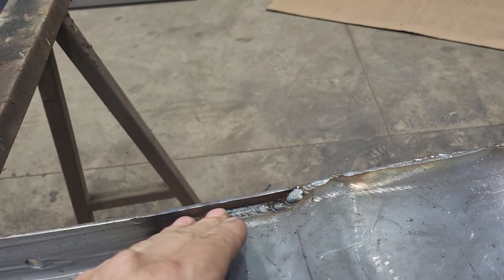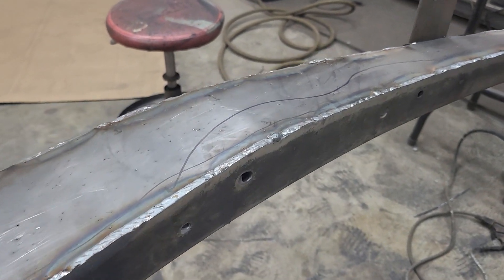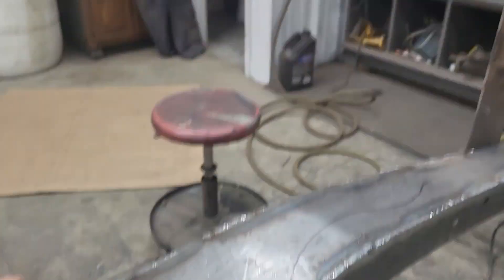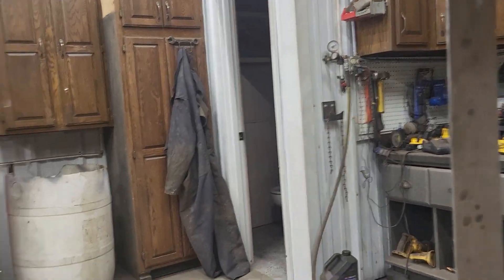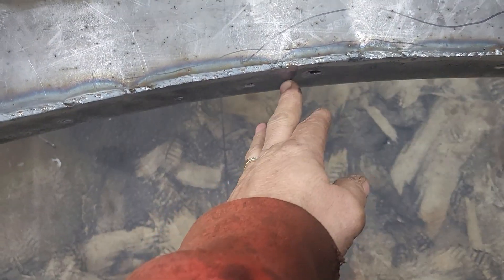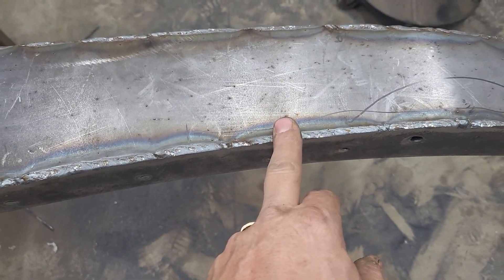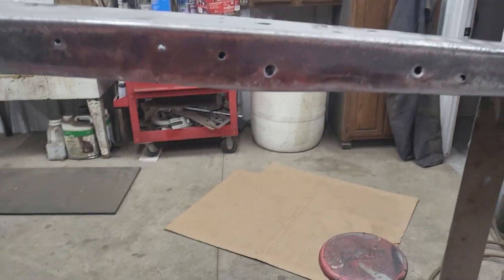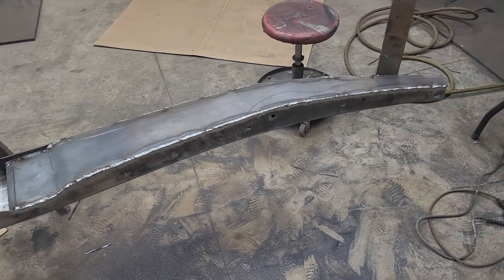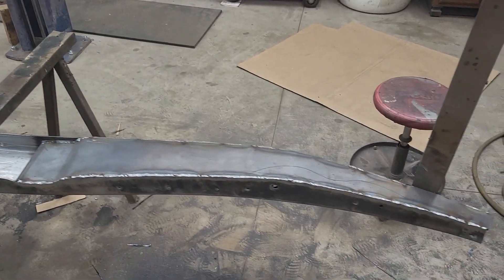There are also two other brakes in here — one right here and one right here — and those are for the suspension mounts. That allows the flat area that was already in the frame, and the mounting areas are right up here — you can see the holes. You've got a flat surface that you can mount your suspension on. Engine mounts will go somewhere in the vicinity and because it's a Hemi they're toward the very front of the engine, so they might even tie into the front suspension — don't know that yet, but that's where we're at today.